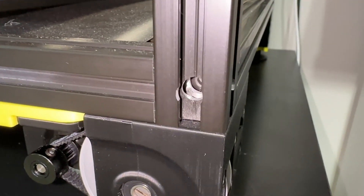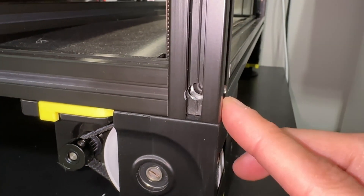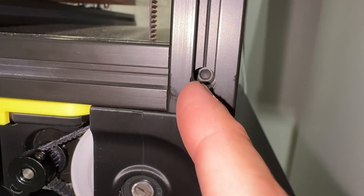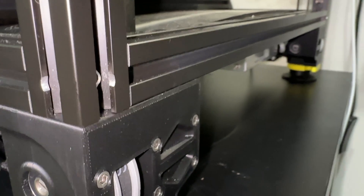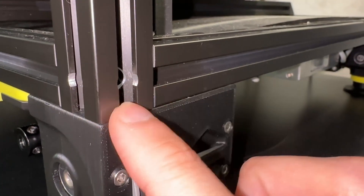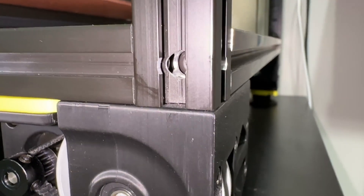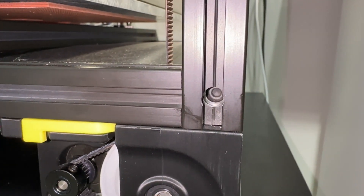The fifth video was assembling the frame, and the big mistake is not taking time to properly square it. This especially applies to anyone cutting and tapping off-brand extrusions with no experience doing so. It's very hard to beat professional cutting machines, and you might not find problems until later in the build when it's much harder to take everything apart. The advice for beginners? Don't be cute — just buy the Misumi extrusions and pay extra to have them cut and tapped correctly.